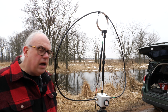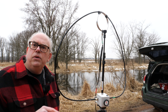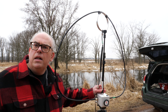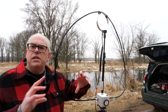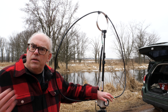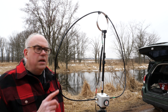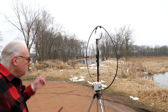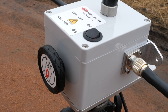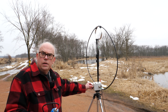Those two limitations — power and bandwidth — are why people think this is a compromised antenna, but it really isn't. It is a very efficient antenna and it works very well within the parameters for which it is designed. For QRP operation you're going to have fairly good luck with this despite its tight bandwidth. So enough of me talking — let's get it tuned up for the 15-meter band and put it on the air. I'll flip this little switch here: 30 through 10 meters, and 80 through 40 meters — just two different ranges on this capacitor. I'm not sure where I need to be, so I'm just slowly turning the dial.